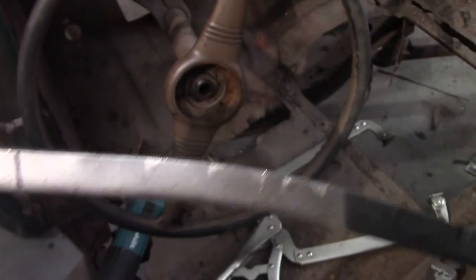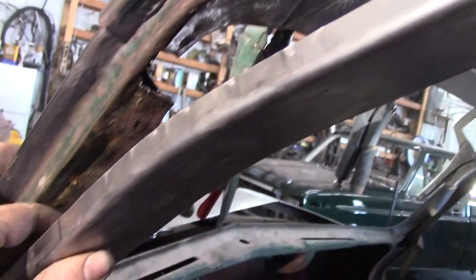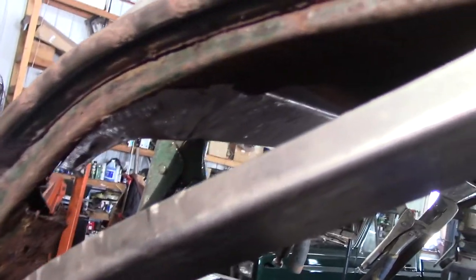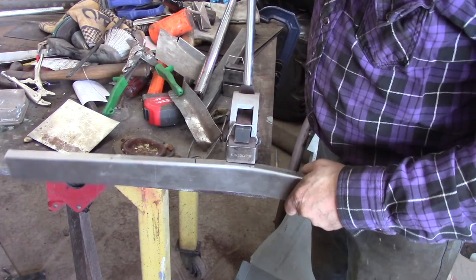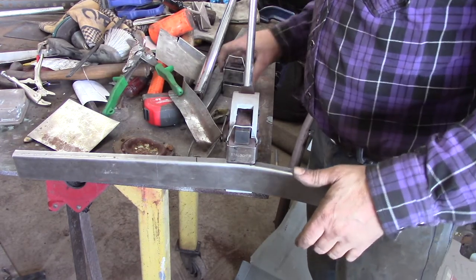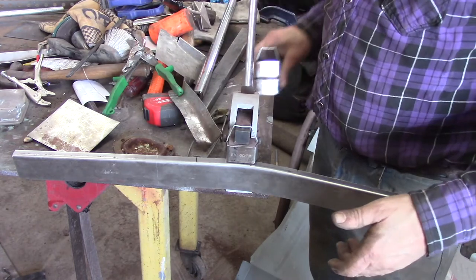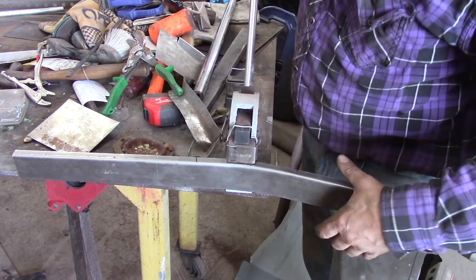So I'm gonna take this piece right here — I cut it two inches, that's the width here, plus I added a half inch and put an L-bend on it in the brake. Now I'm gonna use that shrinker/stretcher and tune it in so hopefully I get it to fit right. Amazing tool. Connor thinks it was about 200 bucks, maybe a little more — 250. Comes with two dies. This one's a Woodward Fab, but I think Eastwood has one too. It's so cool because I can just stick it in there.